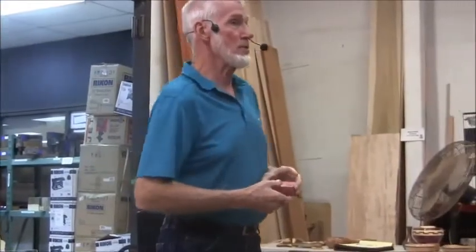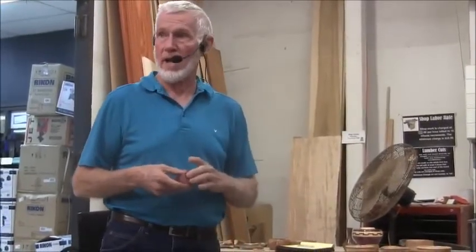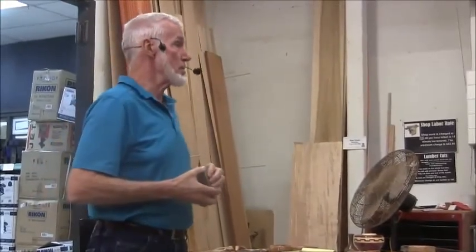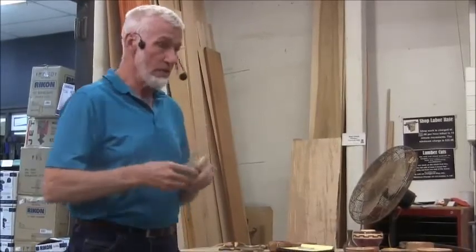The vacuum process is a rather unique process. I don't think the majority of people recognize the strength of vacuum — it can produce an unbelievable amount of pressure on a piece of material. This is a block of wood that had a little dye in the resin. I processed it with normal processing and then cut it in half. You can see that the material is just the same color on the inside as on the outside, basically proving that the resin goes all the way through. The process we did last Thursday was very abbreviated, yet I'm told the resin had saturated the wood all the way through.